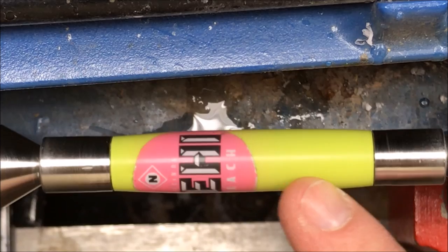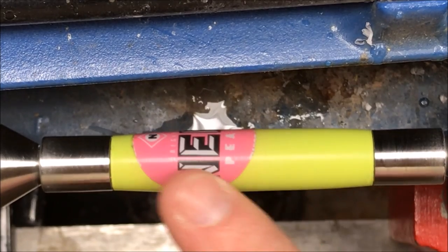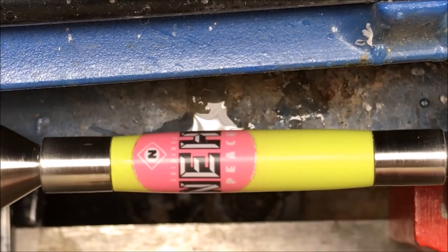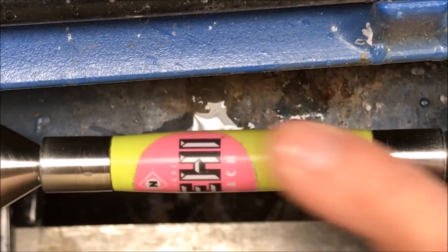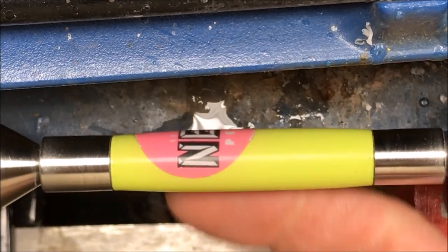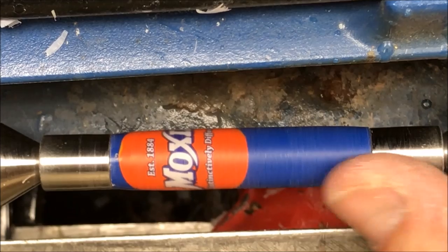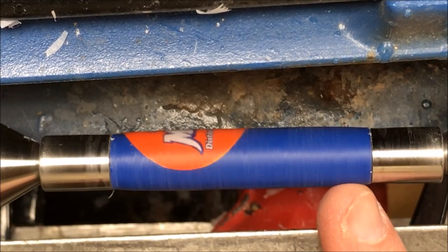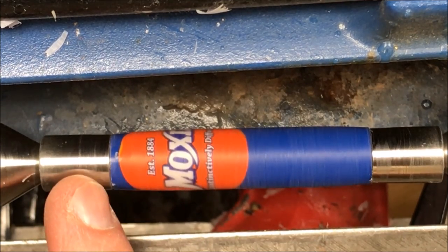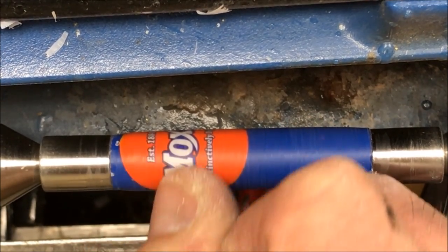Here's a quick peek at the blank right out of micro mesh — it looks phenomenal. From end to end it's absolutely amazing; you cannot see the repairs with the CA, it blends right in. I have not buffed this on the buffing wheel yet. I'm going to get the other two blanks turned and repaired as best as possible, then we'll buff them at the end. It looks like I got really lucky with this Moxie blank — down at this end it looks perfect.